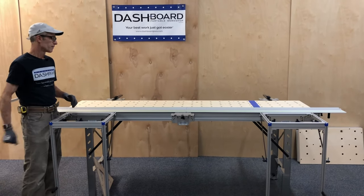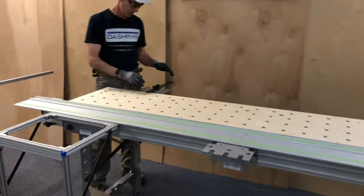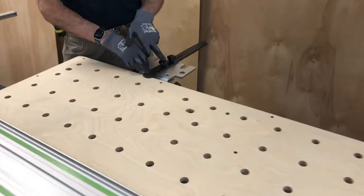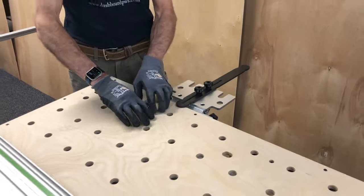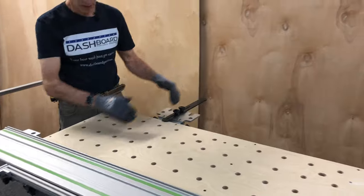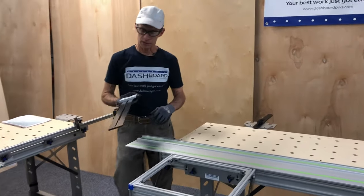You put the spiral dog into the slots on the track stars, and that aligns your guide rail with the grid of holes, track stars, and outriggers. You're going to base everything off of where this rail is and not move it — you move the material. At the back of the table I've got some other track stars along with our parallel guides, which are adjustable, and they use our expand dogs to fit in these holes.